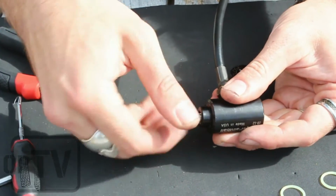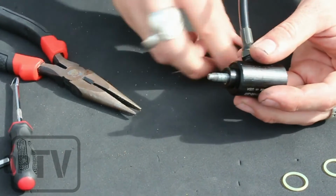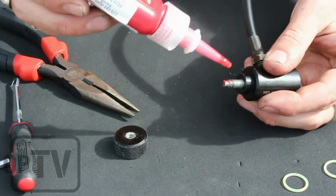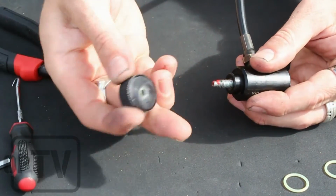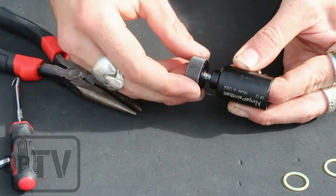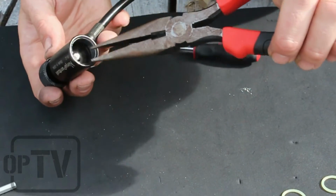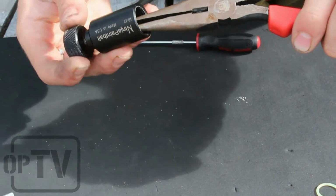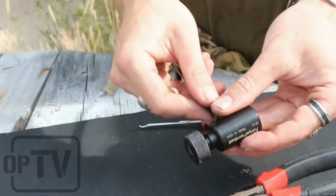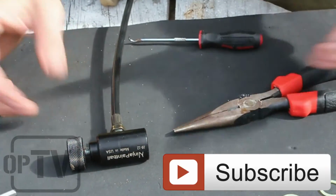And bring that out enough so that you can put the knob back on there. But with these ones here, if you have to break the Loctite, it's going to make sense to reset new Loctite. So there's this full strength Loctite, but I'll just put a tiny bit there like that. Lid back on there. Screw that on nice and tight. Okay, sometimes if you want to get that a little bit tighter, you can hold that pin there and then tighten it up a little bit more. There we go. So about there. Feels good. And then I'll just leave it for a little while for that Loctite to set. Cool. So that's it. So that's the replacing the 4 O-rings in your remote line slide check. Sweet. Easy as.